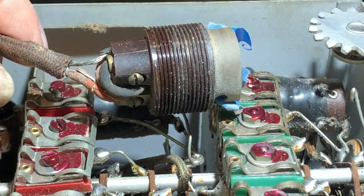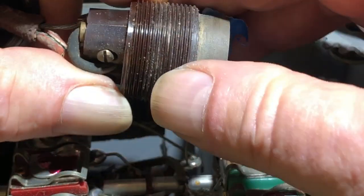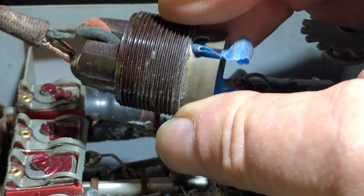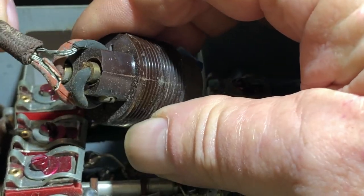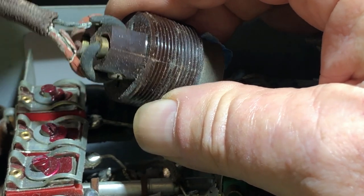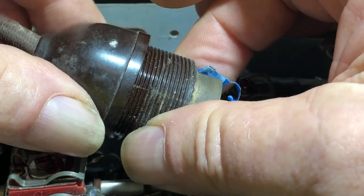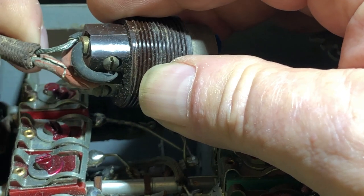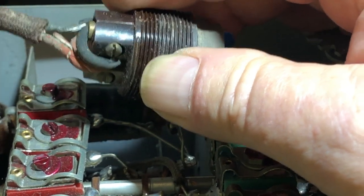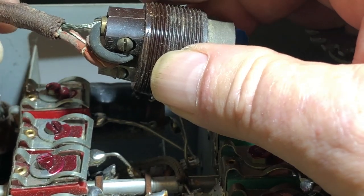I was just changing the mains power cord, and I thought I'd also check the cord that runs the 240 volt light for the dial lamps. It's just a 15 watt incandescent globe. And it's in truly frightening condition. Look at that. It looked fine from the outside. I didn't see anything wrong with it. It was just like that. And the other end of the cord looked good. Gee, I'm glad I didn't move that while I was working on it. Anyway, I'll try and reuse the outside fabric cover for this and run some new wires.